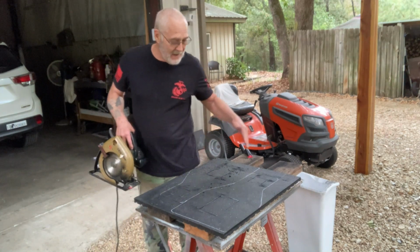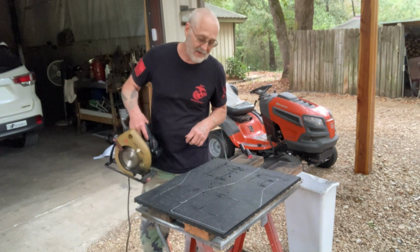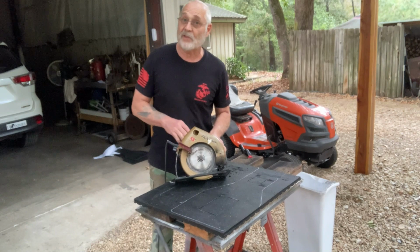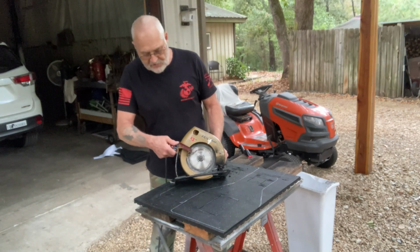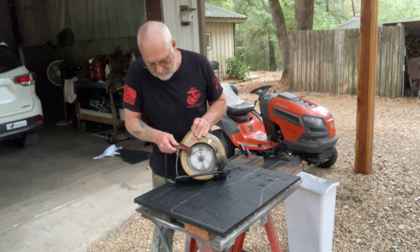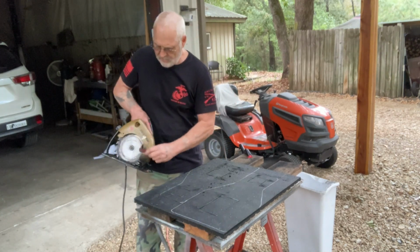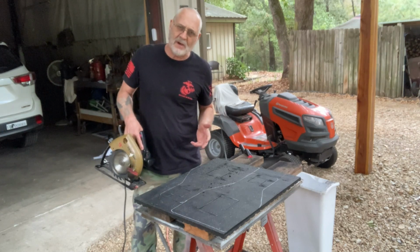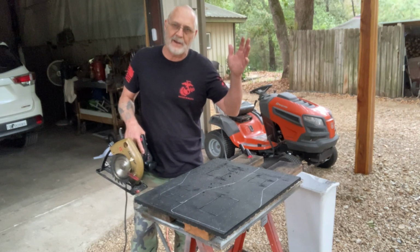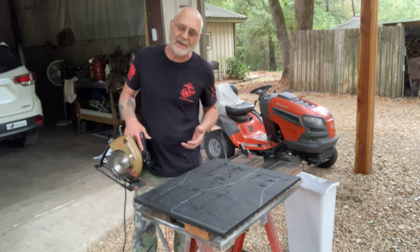Okay, so I have made my initial cuts, my shallow cuts, very shallow, about 1/8 of an inch. Now I'm ready to start my pattern cuts to cut the targets out. I'm going to start by setting my saw at 1/4 inch depth and just follow all the lines, because if you try to take too much of this at once, you're just going to smoke up the place and you're not going to get very far. So I'm going to make shallow cuts and make a few passes, and I'll eventually get it done. Here we go.